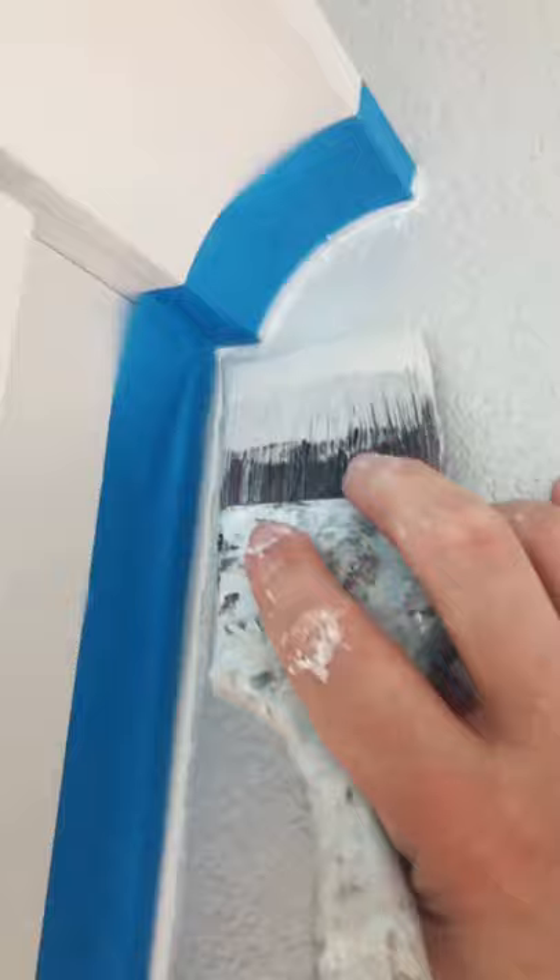You've got to be fast a little bit. Don't let the caulking dry too much because it'll stick to your blue tape and then it won't look that good. I'm using an eggshell. Pull the tape towards you — look at that nice straight line. That should last for a while, and there we go.